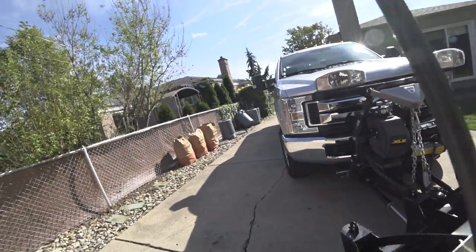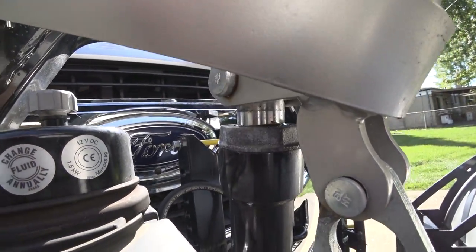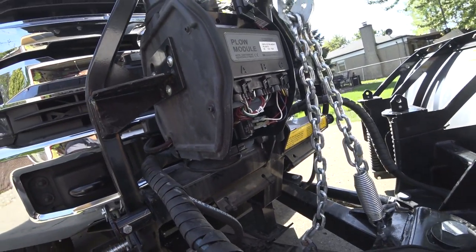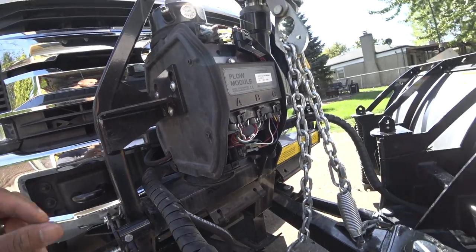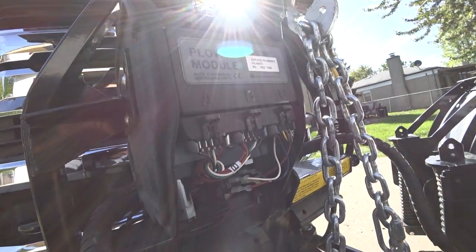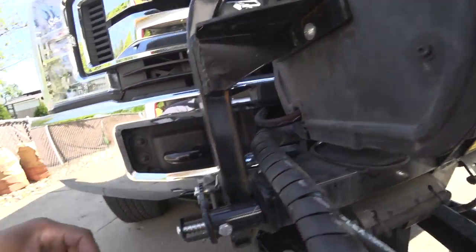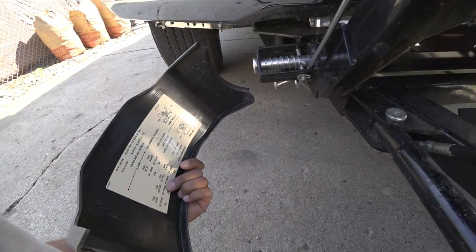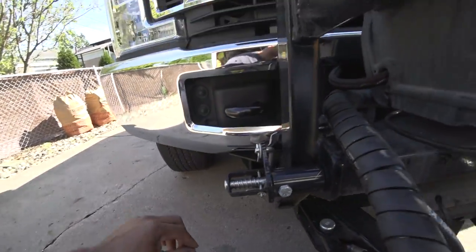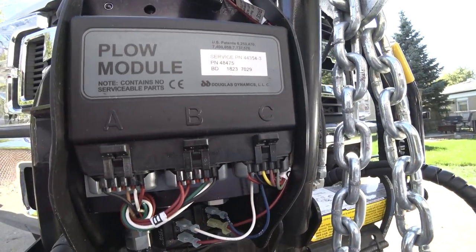As you can see, it pulls the cylinder down. There's a little bit of oil leakage there. All that pressure from the chain was essentially slamming into this module. That is not the best situation. Everything still works, but as you can see, it was hitting right where that sign is — you can see the mark right there.